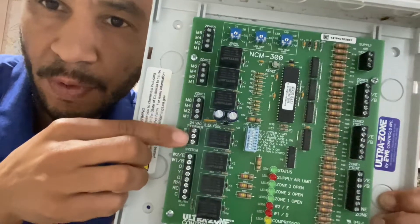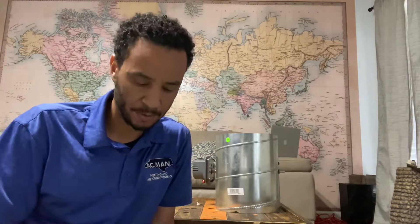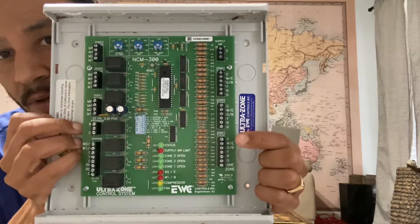Right here is the 24-volt transformer, R and C. You cannot take the transformer in the air handler and wire that to a zone board — you must put a separate transformer, separate from what's manufactured in the unit. So what you're going to do is mount it in the air handler, take the voltage — let's say it's a 240-volt system, a heat pump, not a furnace — wire that to the air handler, and then take the 24 volts and connect it right there where it says 24-volt.